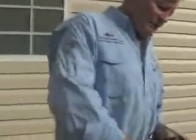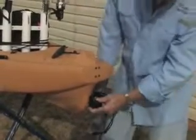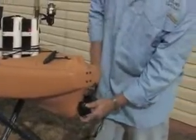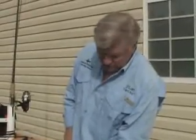But first I'll show you the way that I do it sometimes when I'm just building a boat to fish on the lake. I come back here to the back and I put a bracket where the rudder would mount, an aluminum strip that goes here and bends forward so it'd be out of the way of the rudder. And then I mount the transducer just above the bottom so that the bottom hits something the transducer doesn't hit. That way the temperature gauge works, the sensor works immediately so you can detect temperature changes.